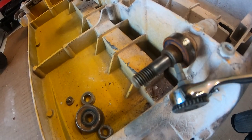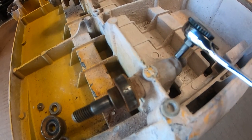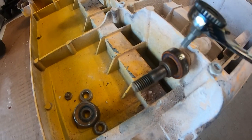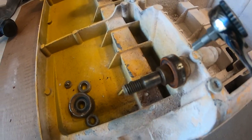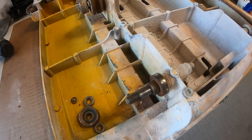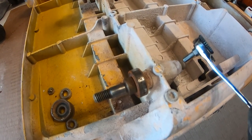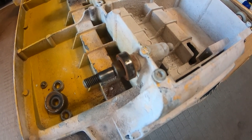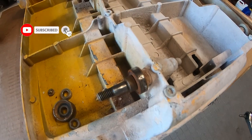You can see that the bearing is pinned in by the actual bolt — this is a molded part of the bolt — and the only way to get this bearing off is to take the other side lock nut off and tap the whole stud through, which will release the bearing. It's a job, and you need an extra nut sometimes — you have to borrow one from another wheel. The only way to keep this bolt in position once you break it free is to use a jam nut, because these just don't want to cooperate and will turn on you.